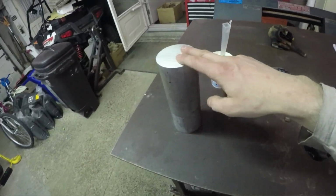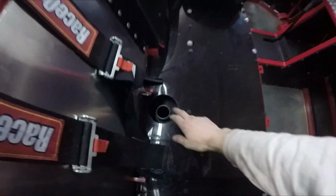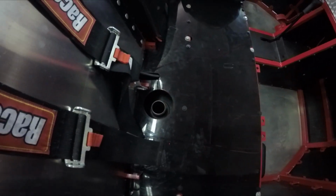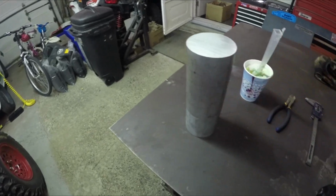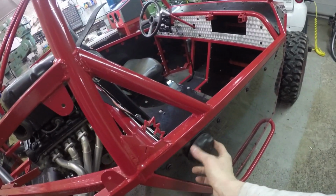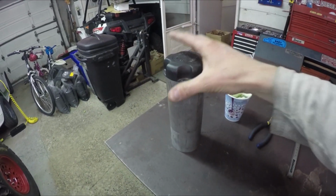bought this piece of aluminum, and I'm going to cut an internal thread on this that screws over top this cap right here. Now that's a 5 thread per inch. Well, it's a pretty big thread, but my lathe can cut it. So I'll make an adapter there that has a hose connector. And then on the other end, I'll basically do the reverse. I'll cut an external thread. So I'll have the thing sitting on there somewhere. Okay, head over to the lathe and we'll start cutting this guy.